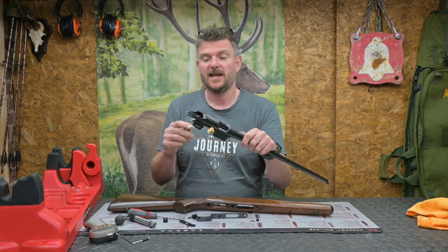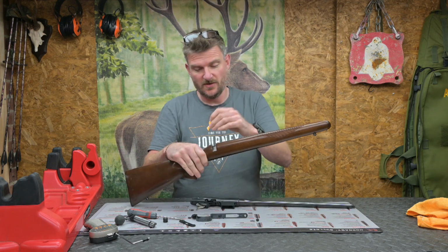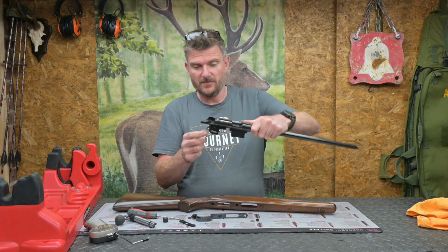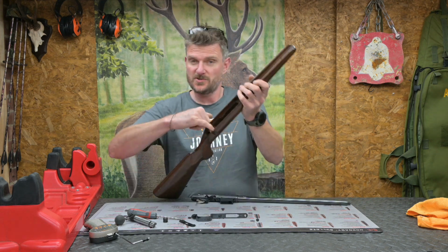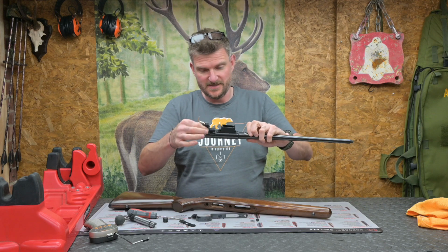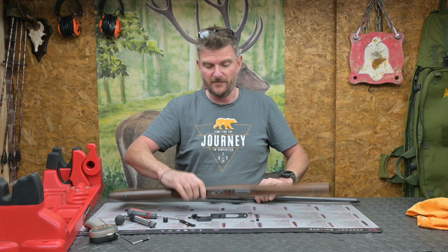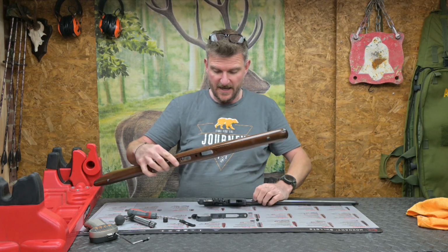It takes slightly longer because you do have to make a few adjustments to the inlet on the actual stock itself. Now there are these two extensions on the back of the sears here, and those do have to be put back into where the rear pillar screw goes. You've got to broaden it ever so slightly for the trigger fitting itself, and take a little bit off the front of the trigger pocket here, and then it will go in.